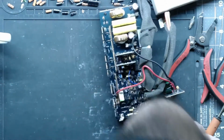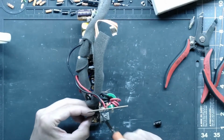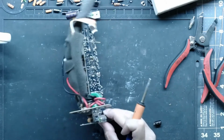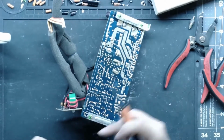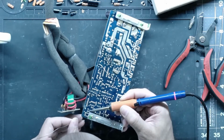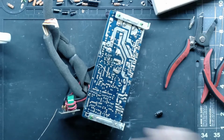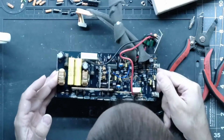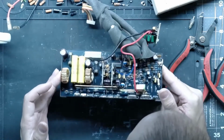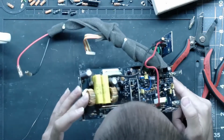And we checked the polarity on that. I'm just going to double check it because sometimes when I'm talking I make mistakes. Yes, the little plus sign is there. I hate when they put the polarity underneath the cap. Whoever does that on a board's an idiot. I like it when there's a minus symbol or a dash or something clearly visible that says, hey, this is where this leg goes. Because I can look at the top of this board and have a ton of mistakes on there and I'd never know. There's no notches. There's nothing to mark the negative polarities on any of these.